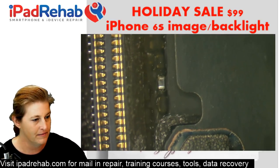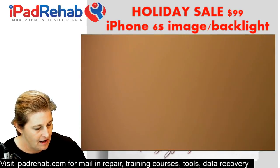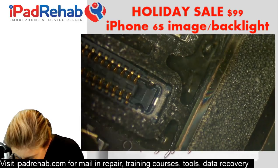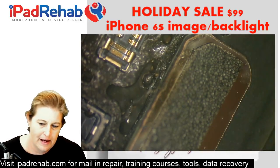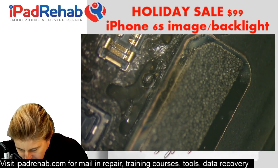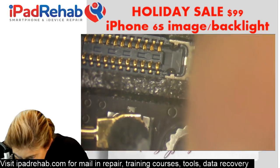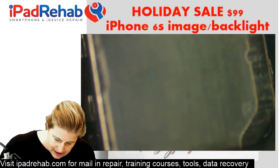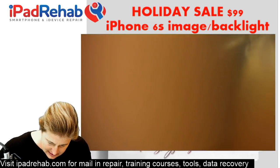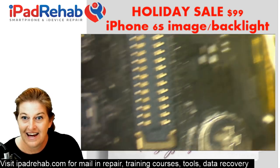We have a problem we know — the backlight filter. We're going to try to get that off and see how we do. First I'll pull the camera flex out of the way and tape it back to clear that area. Now if we do end up with missing pads, we cannot just jump. That's a common question at Practical Board Repair School: can I just jump the filter if it's gone, why not just stick a wire there? On a 6s you can't do that.